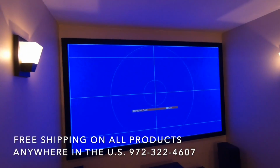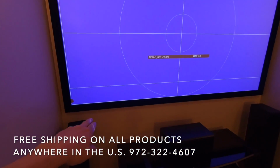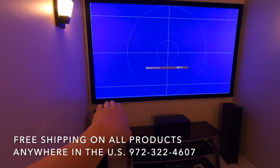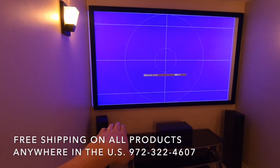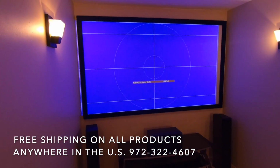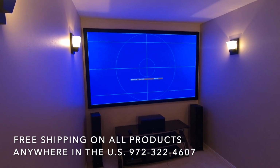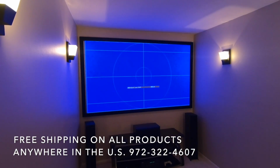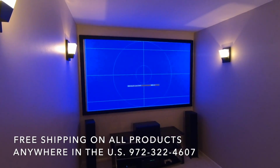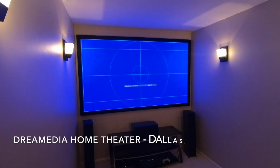So now that the top is completely level across the top, you see how the bottom is a little bit higher on the left-hand side. You basically just move the projector to the left just a little bit, and what that'll do is square up the image. Then you shift it back to the right. And it looks like we just turned it a little bit, so we're going to go back to the right a little bit with the projector. This is why the fine adjustment mount is a lot better than just doing it with force. But you can get it, it just takes a little bit of back and forth.